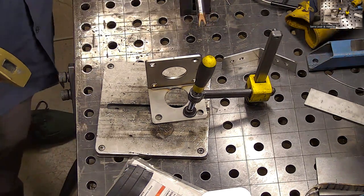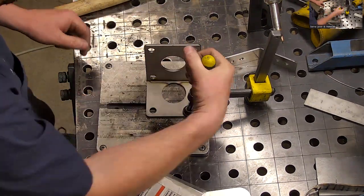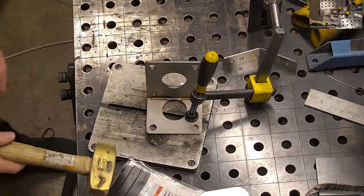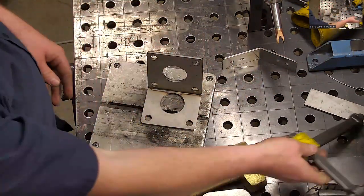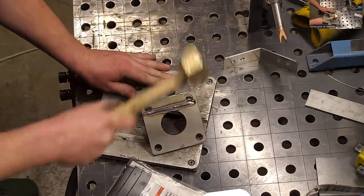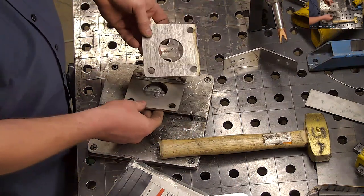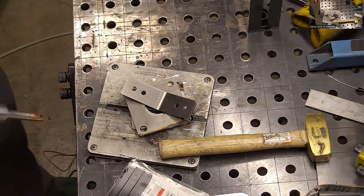Welding gun out of the way. Breaking the clamp. Yeah, I think the clamp broke. All right, so we're able to break it. Anyways, see, I needed either slower or a little bit more narrow weld to get all the way in there. But kind of an example of the spot welding condition. See, with a thinner material, more practical case, it's pretty easy.